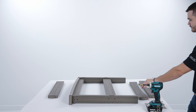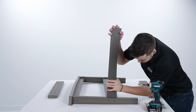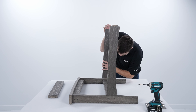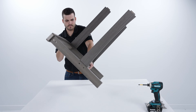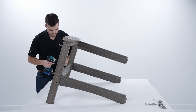Lay the right arm and leg assembly facing down onto the work surface. Attach the arch brace to the front of the arm and leg assembly. Next, attach the two back braces, fitting the mortise and tenons of the two pieces together. Fasten using 4-inch bugle head screws in the pre-drilled holes.